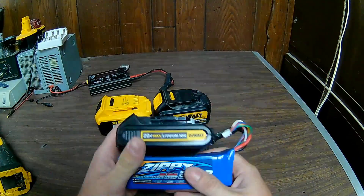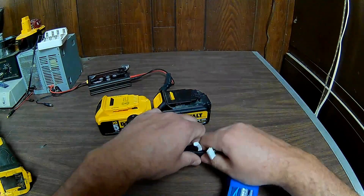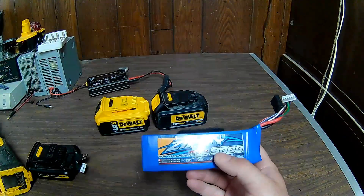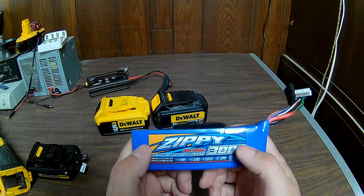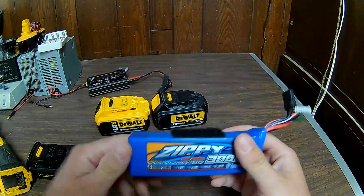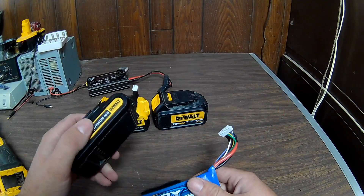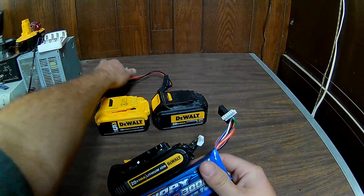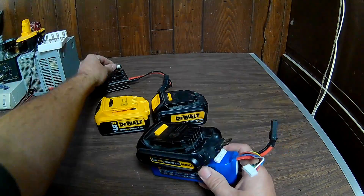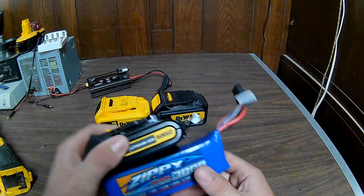The good part is you don't want to over-discharge these batteries. Lithium polymer batteries are rated not to go below 3 volts per cell, whereas lithium ion might be slightly less depending on the manufacturer. Now the DeWalt case will actually shut off when the pack is dead, which is good — it's almost dummy-proof. I also have a little voltage indicator that will beep when it gets to a certain point as a backup.